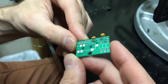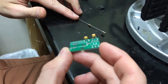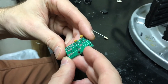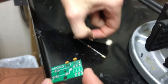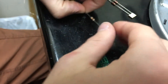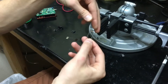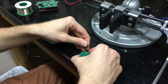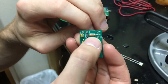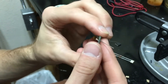I'm going to put in the 10kΩ resistor first — that's the resistor that's all by itself. That resistor is R2, which is right in the middle here, so we're going to put that resistor right in the middle. Then I'm going to put the other two resistors, the 1.2kΩ resistors, as R1 and R3. The easiest way to do this is to just bend the leads of the resistor and then slide it in. So there's 10kΩ, which is brown, black, orange — placed in as R2 with leads bent so it's not going to fall out.